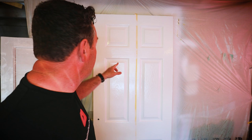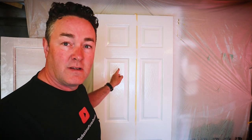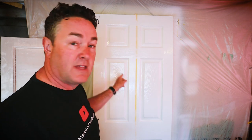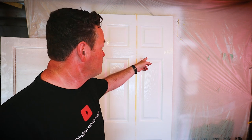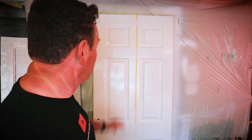That goes on lovely. The flow out of that - you're going to lose the brush marks. I'm happy with that. In the wet state, that is very glossy. I'm going to wash my brush out and come back in a bit to review what that looks like. If it stays as glossy as that, I'm happy. If it dulls off, I'm not going to be so happy. We'll compare against the Technos again - that second coat of Technos gloss was two days ago and I'm happy with that gloss. Let's see what this gloss is like when it's dry.